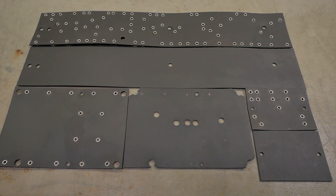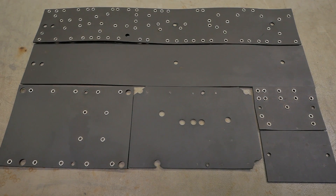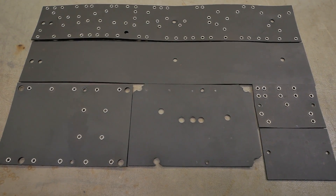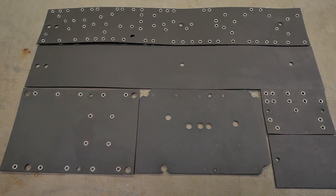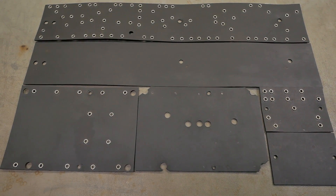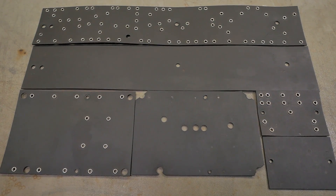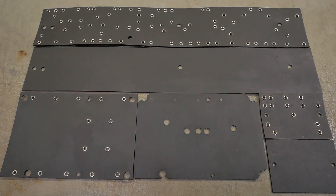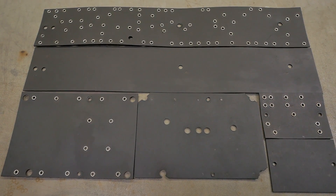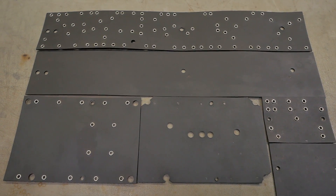Look at those beautiful boards! I get a lot of people asking whenever I do this - "oh, it would have been easier to make new ones." Not really. Transferring the layout is one thing, but these aren't your standard AB763 boards you can get from clone vendors these days - the layout's a bit different, the screw positions are a bit different. By the time you do all that you may as well just clean the originals. Everything stays original too, the customer feels good knowing it's all the same parts just with the schmoo cleaned off, and you don't have to press new ones or find an aftermarket option that perfectly matches - because none of them really do.